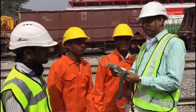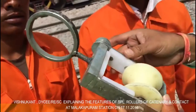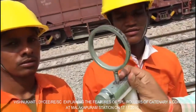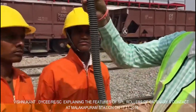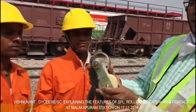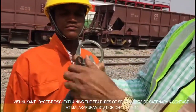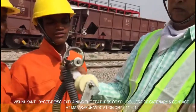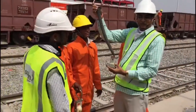We have a catenary clamp on this side, and all around Teflon tape has been applied — it will avoid damage to the catenary wire. This is a perpendicular arrangement; we can put it in the bracket and take the load on this Teflon pulley. Another contact clip has been provided; through the chain it will be fixed to the bracket. There is flexibility, and a Teflon pulley is fitted there as well — it is easy to open and remove. So catenary and contact can both be maintained at a set distance apart.